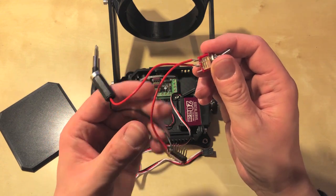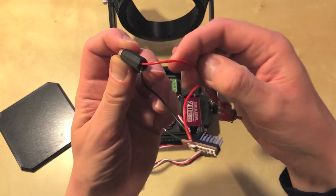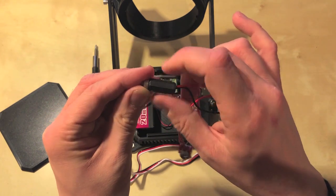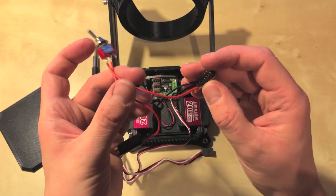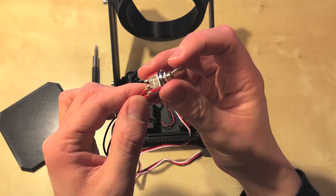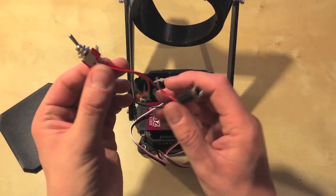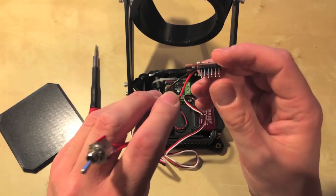So what have we got here? You could just use the existing power supply, but because I want to use thick jumper cables I've bought a female barrel jack and soldered jumper wires to it. These are normal jumper wires rated to about 4 amps continuous current. I've connected the positive to a switch — a normal toggle switch, pretty easy to get hold of. And those of you who are observant will have noticed there is a little hole in the OSR2 for it — planned more than a few days in advance!